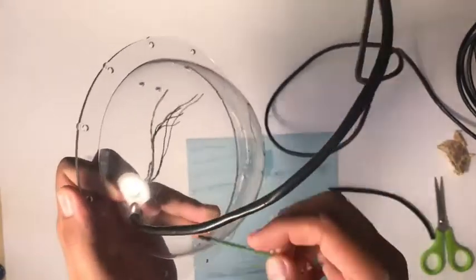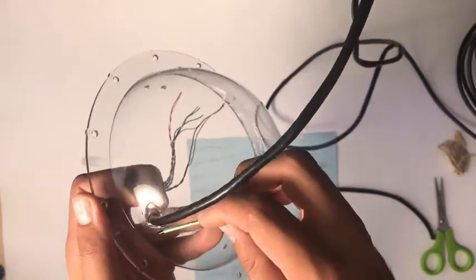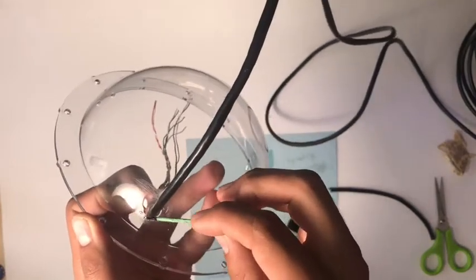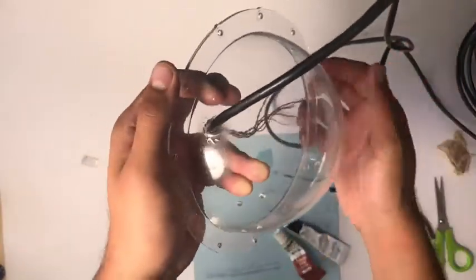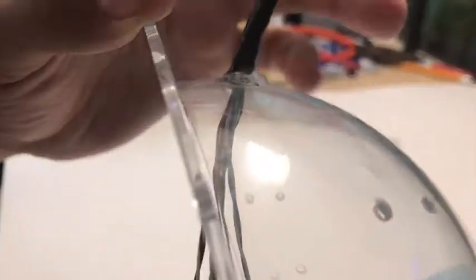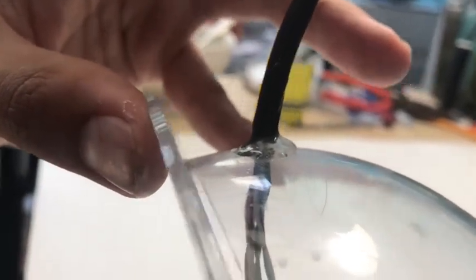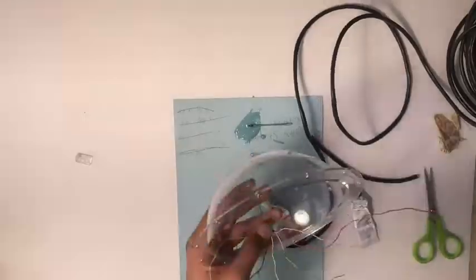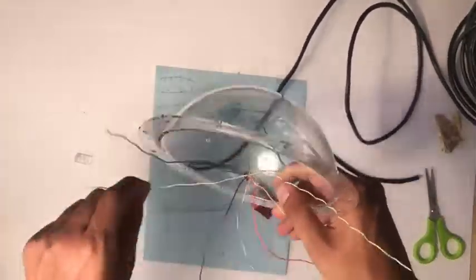Layer more epoxy around the outside of the Ethernet cable where it meets the dome. Be super generous — it's unlikely you'll be able to add too much epoxy, so make absolutely sure it surrounds every crevice. Once the epoxy sets you should have a clear amount of epoxy surrounding the whole Ethernet cable. In the ROV business we call this potting your entry point.